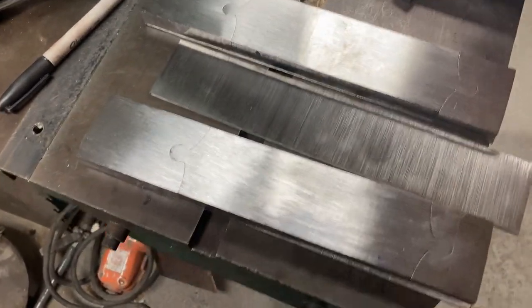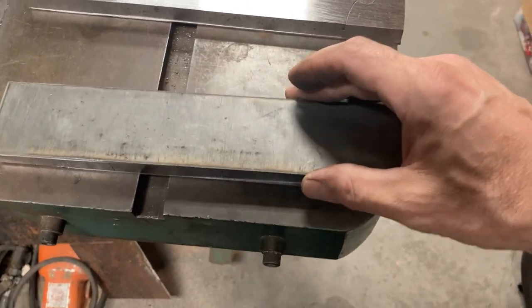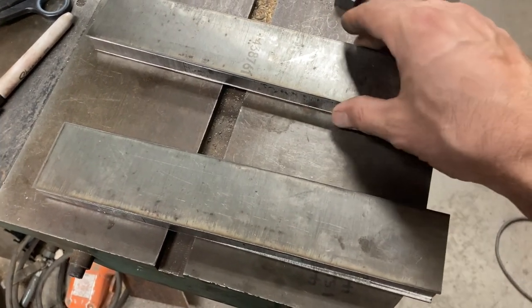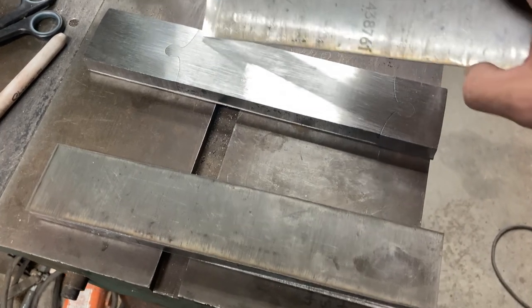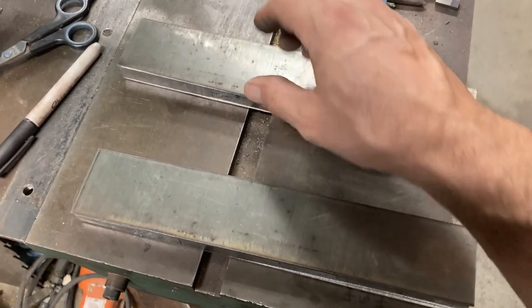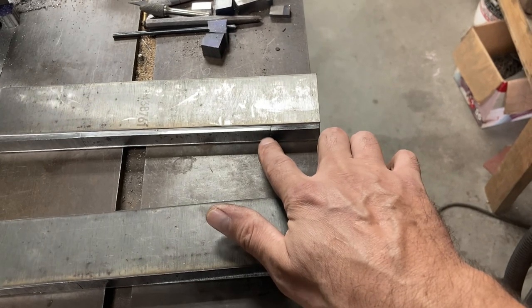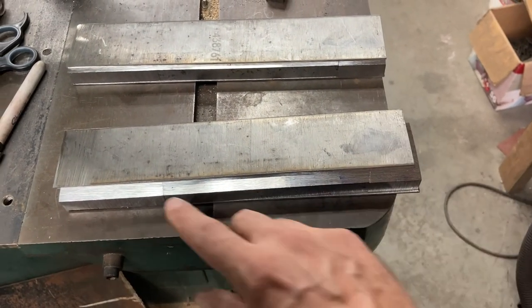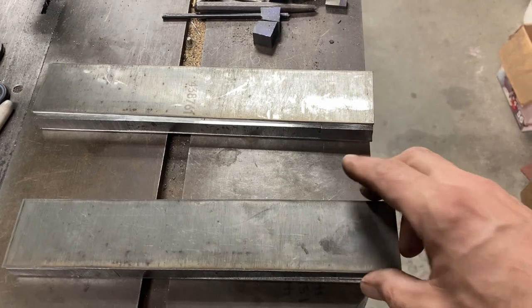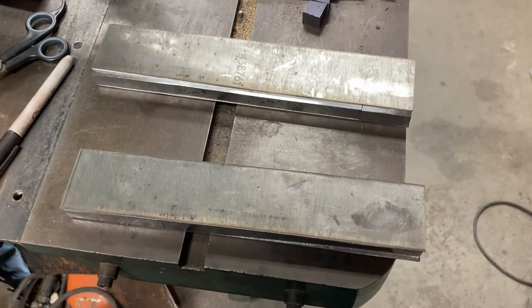composites ready to weld. And then I've made underneath them a plate of 15 and 20. And I got another plate to put on top for gussets. We're going to probably tack weld these very lightly with fusion TIG. Then put the covers on, clamp them down, tack, tack, tack, and then full weld the seams. And then also we're going to stitch down the outside of that and the outside of that seam on both of these. And then they will be ready for heating up and forging solid. So I'll show you when I've done some of that.